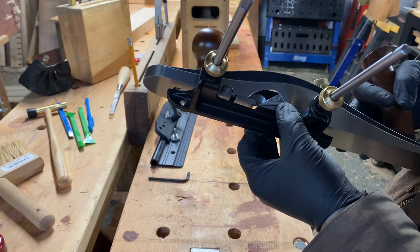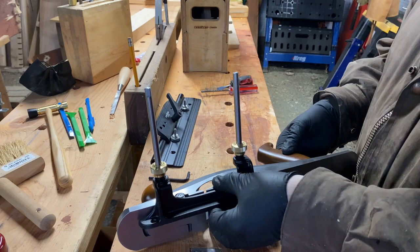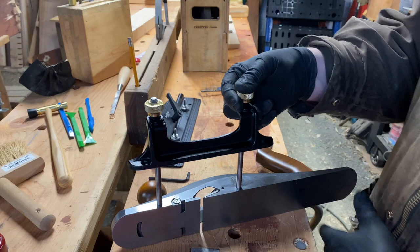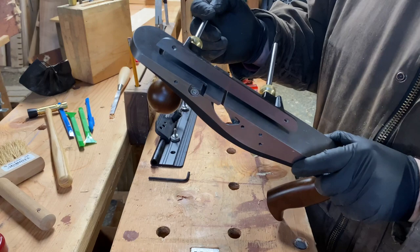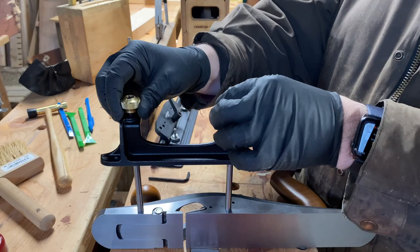You can see there is lots of clearance between the fence and the blade. Under no normal operating circumstance are you going to run the blade out into the fence. The fence locks into place at any position, including well away from the blade, so you can do rabbets, dados, and all kinds of work — even rabbets that extend well away from the edge of the board.